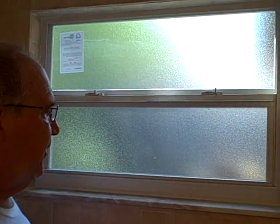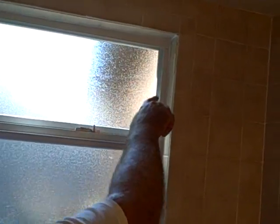Now we've gone ahead and finished our caulking all the way around. Again, I use my wet finger to make sure that the caulking goes in the crack and not all over the window. With some of that expandable foam up there, we're going to have to come back. This top one is going to expand a little bit more, but our sides seem to be fine. We're going to let this caulk dry on the inside now, and we're going to go outside and finish up out there.